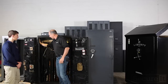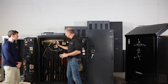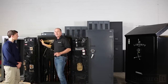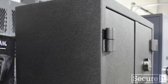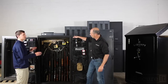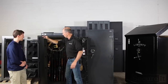Our safe on the inside, we have to take the time to properly seam weld everything, polish the welds, and go through and really clean and properly polish all the steel prior to the powder coat finish, because we want the inside of this to look as good as the outside. It's a lot more work than just throwing in drywall and carpeting, and it looks good inside and out. Now, the interior is nice steel design finish. There's no drywall. So let's talk a little bit about corrosion and drywall. Yeah, we made this safe as the answer to all the problems with the gun safe.